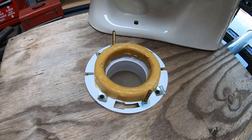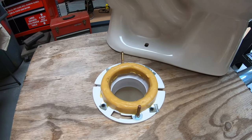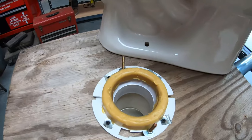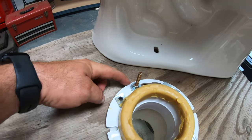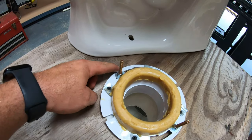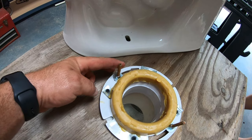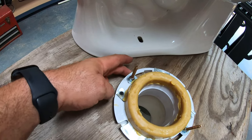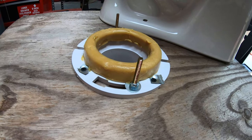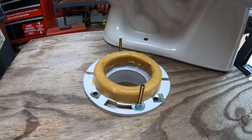You can't tell whether the flange is okay or not until you pull the toilet. A lot of times we get calls and customers say they have a rocking toilet, and most of the time it's rocking because the flange is broken or cracked. Most flanges look like this or some variation — some are cast iron — but if there's any rock to it, the plastic will break off and the toilet will rock even worse. It just compounds the problem and we end up having to repair the flange.